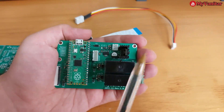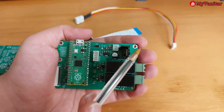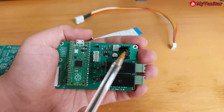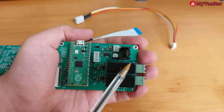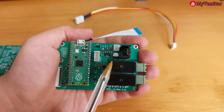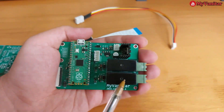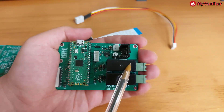Here is the input voltage for the regulator and the board. This is the first prototype — in the latest revision of the board, which is available for you, I have replaced the two regulators with a D-PAK 5-volt regulator. Be careful about that — the D-PAK type is better, and you don't need any heat sink anymore. These relays will control the heating and cooling elements.